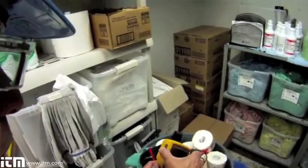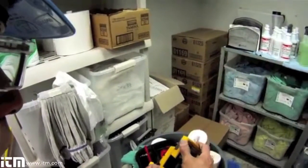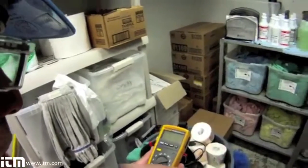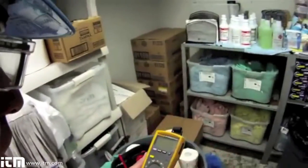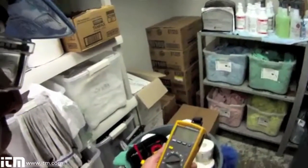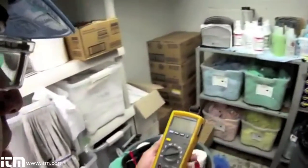This particular meter has a removable display, and because of that removable display, I'm not wearing FR gear today — I'm not wearing my fire resistant gear. All I have are my safety glasses and just good practices. I'm going to check the amp draw in this unit while it's live and running, and do it completely safely.